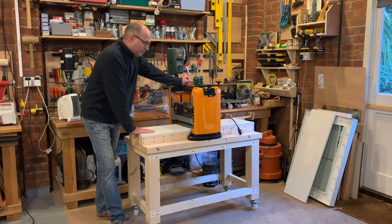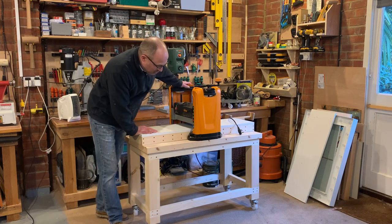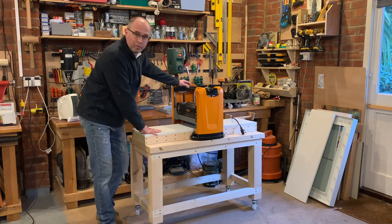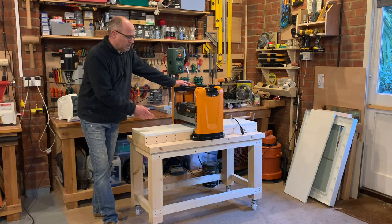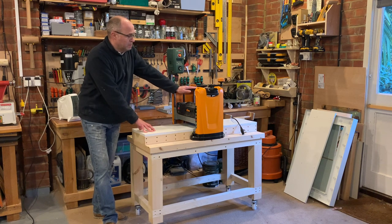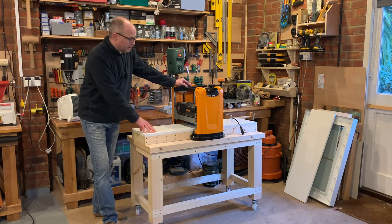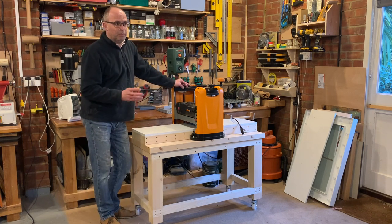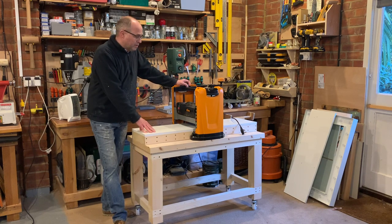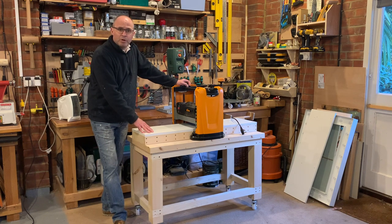There we go - one planer thicknesser bench table, call it what you will. I'm really pleased with that, it's come out better than I expected. It's nice and level. There we have it - one planer thicknesser table bench completed. It's really easy to move around, it's on casters, and the casters are lockable, which is quite important on any machinery - you don't want it moving around when you're operating it. What I would say, if anyone's going to make one of these: to get rid of snipe - it reduces snipe but it doesn't get rid of it completely, and I don't think you ever will with one of these machines. There are other ways around that by making trays and so forth. I built this really for my own reasons - I like to have all my tools bench-mounted on wheels and casters. I want my tools on benches, secure, fixed down. I'm pleased with the way it's come out. If you like the video, please give it a thumbs up and subscribe - thanks a lot for watching.